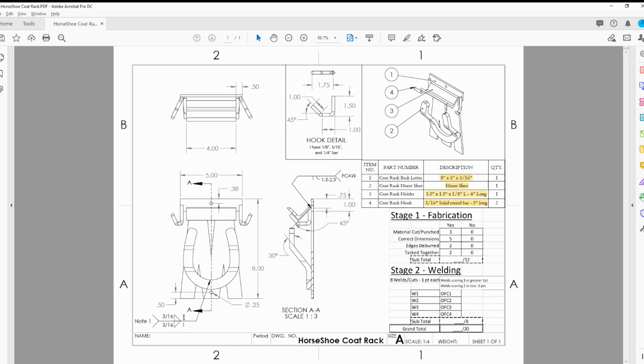You'll have a one and a half dash two and a half weld up here on the top. That means an inch and a half weld spaced out two and a half center to center - it essentially works out to an inch and a half weld on either end. The note says you need at least these two welds centered, but add more if possible. You'll have four welds graded total. Good luck.